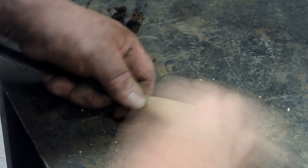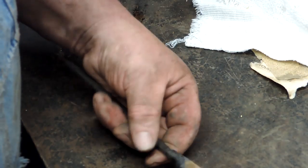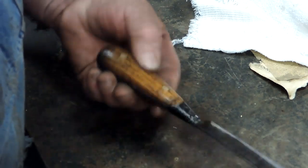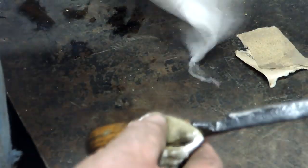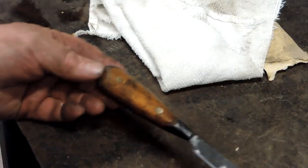The good thing about these wood handles is that they're pretty much self-aligning — the way they're ground and shaped. I'll put a little wipe-on polyurethane on it and it'll soak in a little bit and protect it. It gives it a little more shine but still preserves that antique look. I ended up with a little crack in one of the scales — the pins I drove in were a little big — but a little bit of two-part epoxy took care of that. We take the heads of these pins down, sand it up again, just make sure everything looks nice and even. It'll open a letter.